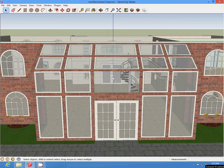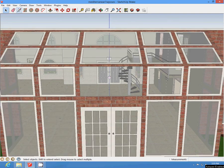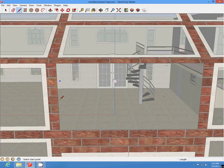We're going to add some trim around the back window. So we start at the edge point, come up two inches, draw a line across, come over two inches and draw that line up.